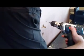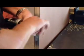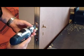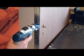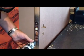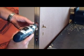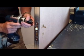Once you've marked off all the holes, I'm always in favor of drilling a pilot hole for the fixing screws. Pilot holes, depending on the timber, I would never exceed a third of the size of the screw for a pilot hole. In very soft timber, I might go to as much as 2/3 in hard timber. All our pilot holes drilled.